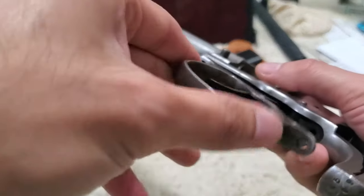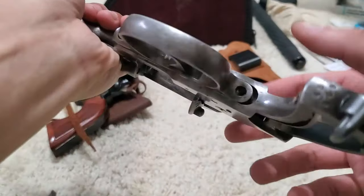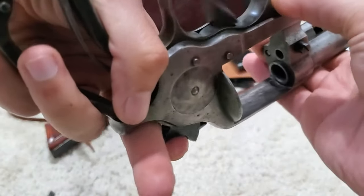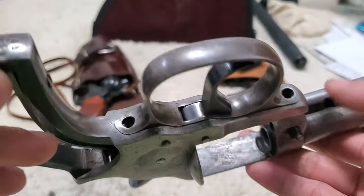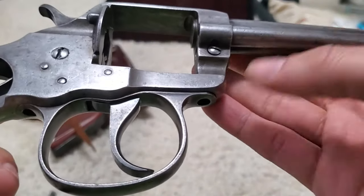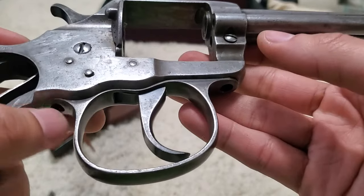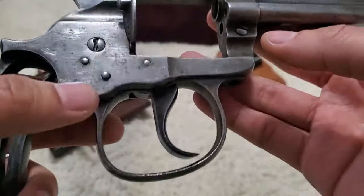Here's the trigger guard. We place the guard over, but it won't fall in because the hammer has to be caught. Regardless, it won't fully seat. I'm going to cock the hammer — it's going to make them fall in — and there you go. It is close to flush on the side closest to the hand guard, but it's nowhere near flush on top and in the front. You can see all that space that's still in there. I can press on here but it pushes from the other side. They both have a job — this guy wants to push on the sear, this guy wants to push on the trigger, but they can't decide who gets to go first.